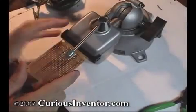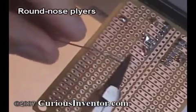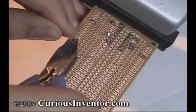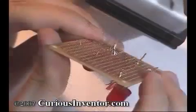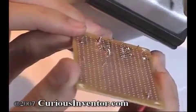Here's the correct way to solder a joint. First, I recommend using a clamp to hold the work, and clinching or bending the component leads so that it doesn't move while you're soldering. Also, clip the leads before soldering because doing so afterwards can crack joints. In some cases, you may need to clean the surfaces with fine-grit sandpaper if they're heavily oxidized. Also, make sure there's no grease or dirt. Flux can only remove small amounts of oxides.